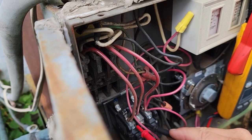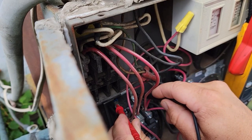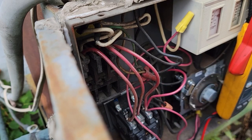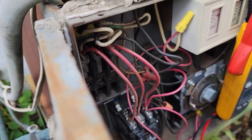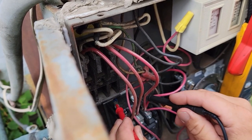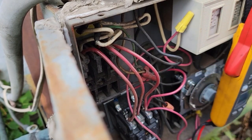211 volts — 211, 211, 212 — going into our coil. We have 211 volts to that coil right there. This is going to be an easy one. The switch mechanism works, but we've got 211 right there. That tells me the coil's junk for some reason.